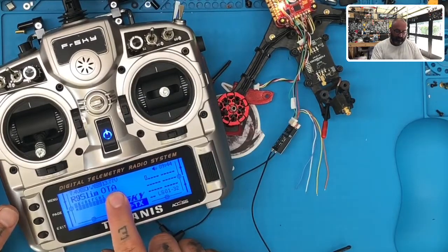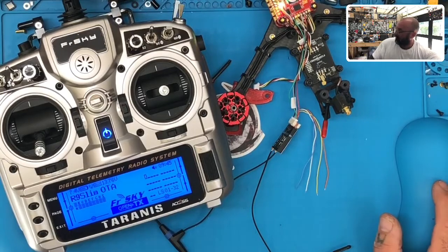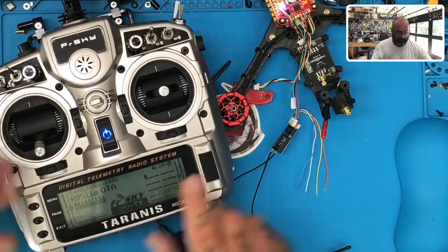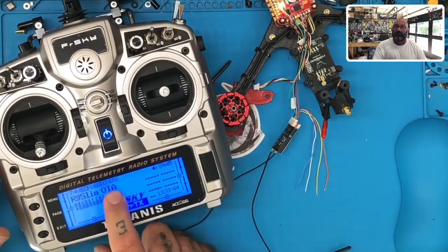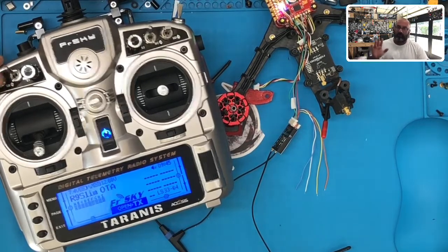We're at 13.76 and I'm in arm position. So I'm going to lower my voltage on the converter here. Okay, now you see how we're at 13.3, I'll lower. There you go. We're below 13 volts, which is what we set on our system. But if I flip the arm switch off, it stops, right? So on, there you go, off, done.